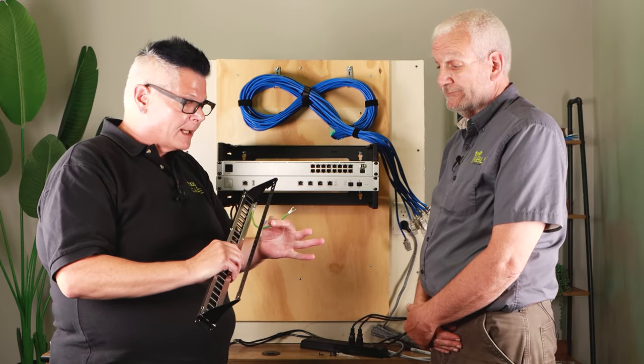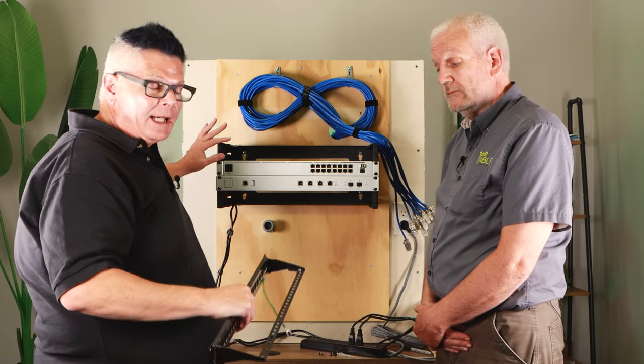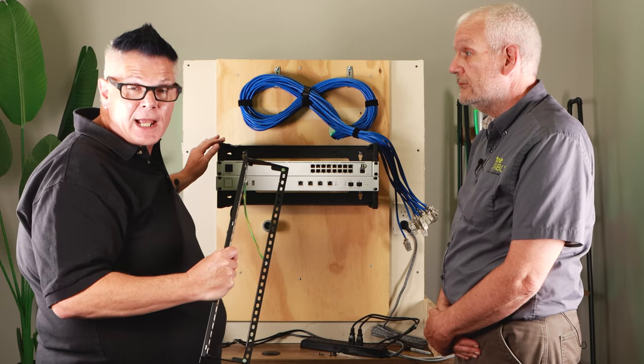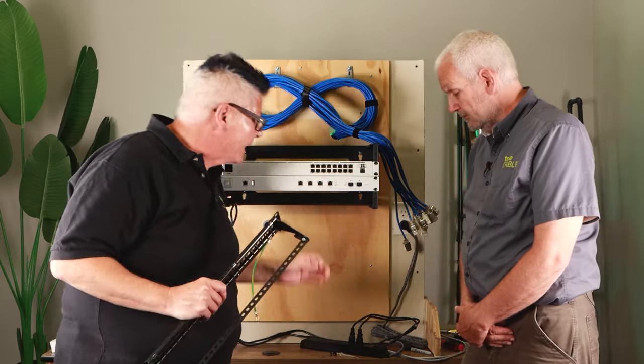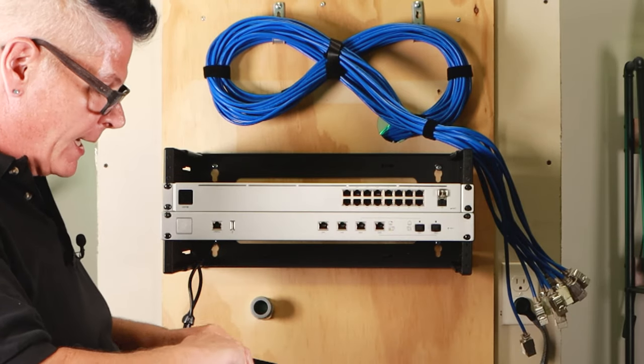If you're bonding to your rack, you'll affix the patch panel to your rack. It's a 1U — it takes up one rack unit, so 1.75 inches high. You'll need to use the screws or the hardware that came with your rack unit, so we're going to go ahead and screw this down.